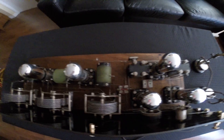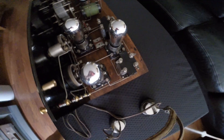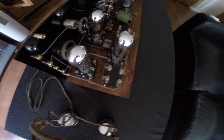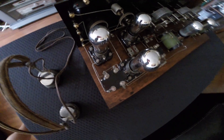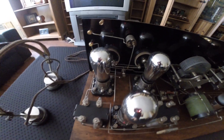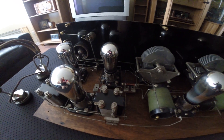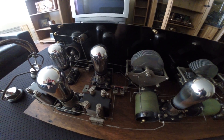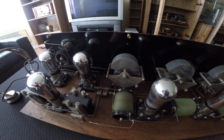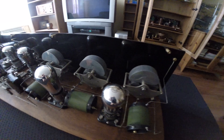Let's look at this side again to see the connections and how it looks. If you look at the connections here, you can see the wire connects and bends at an angle — because you don't want to have a coil-type loop of wire in radio circuits of this kind.